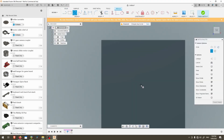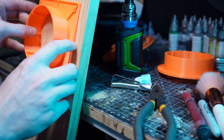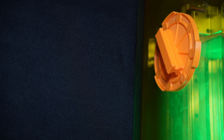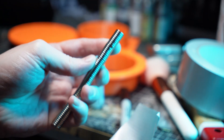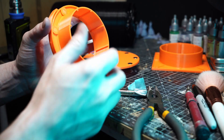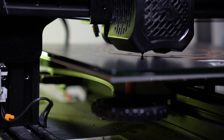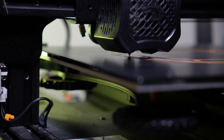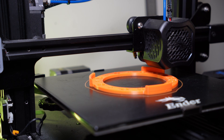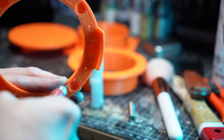I'll use Fusion 360 and set about designing some parts. I knew I was going to need a fitting for the window, another for the printer as well as the hose, and a cover for when the hose is disconnected. The design is based around these 10x2mm neodymium magnets and M3 bolts. I printed these in PLA Plus at a 0.3mm layer height with no supports and they all turned out nice.